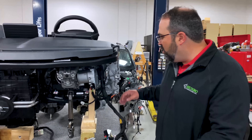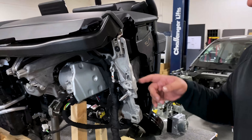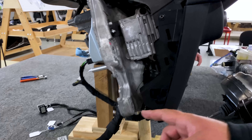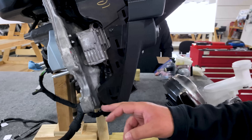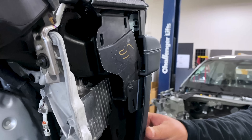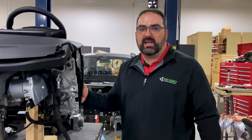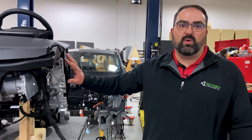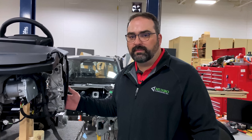As we put this into the vehicle, it gets mounted using all of those mounting features. There are two bolts that go through the magnesium casting and fasten it to the body in white. Access to the top fastener is pretty easy, but to access the bottom fastener, the front panel of the IP had to be pulled off — we had to remove some screws to get at it. We're thinking this front panel may be installed as a secondary process after the IP is installed.